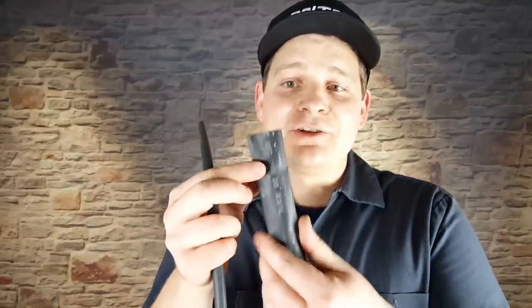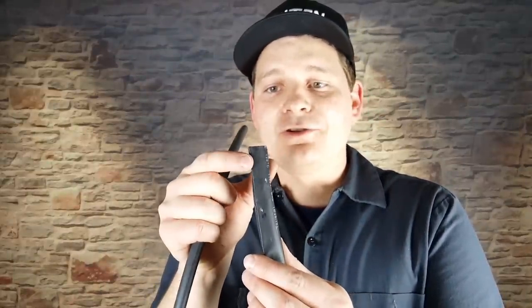In order to get over the connectors, I'd recommend finding one that has a high shrink ratio. If it has a two-to-one shrink ratio, it'll shrink down to half of its original size after you've heated it up. This particular one has a three-to-one shrink ratio, so it can be used on a fairly small connector, and there are all sorts of different sizes up to four-to-one and more. This is a great option if you have that type of controller — put it around the connector, seal it up completely, and that will help.